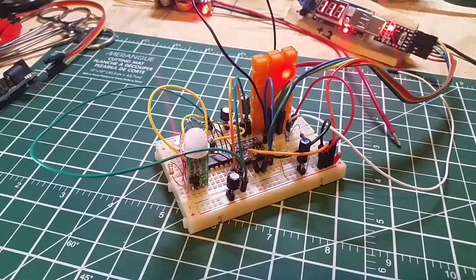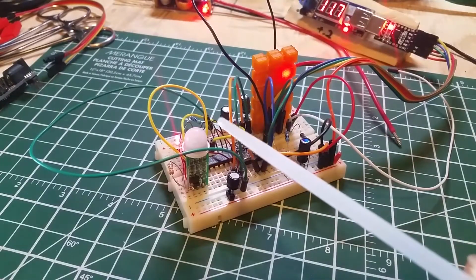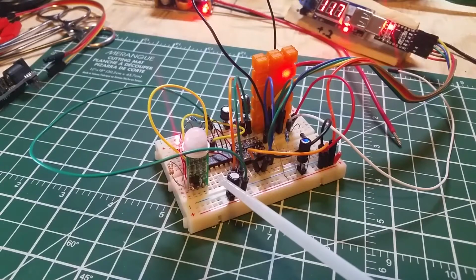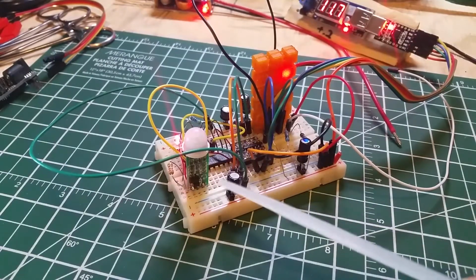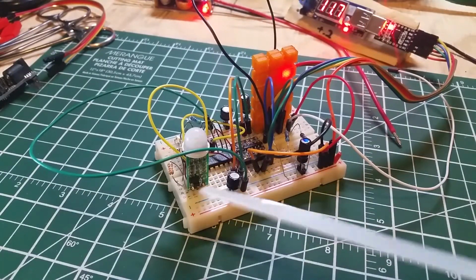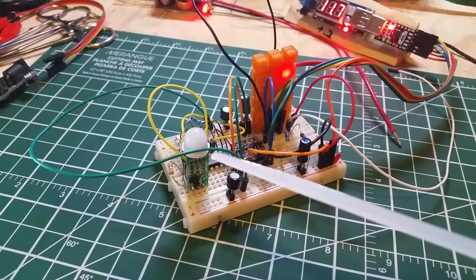The thing is though, it's going to lock. So what's going to happen is the part of the circuit that this is on is feeding back through a resistor to tie it low, because it outputs high. So it's being brought low, just low enough that it'll look like a low, into the PCF chip, and that's an I2C bus GPIO expander, and doing that allows this item here, oh no, didn't get into a lock state, allows that item there to invert its sensing state. The PCF wants to see something pulled low to be on.